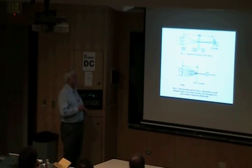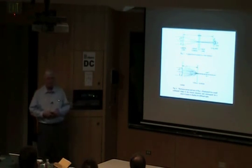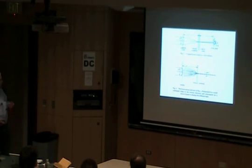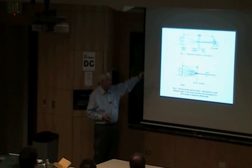So I looked at that and said, well, let's pretend the light's going the other way. We're going to replace the eye with a laser beam and hit the focus screen. What we want the focus screen to do is to spread the light over the aperture of the lens. And that can be described mathematically. You make some assumptions and do calculations. And I want to do 2 things. I want to make it as blurry as I can get it without losing too much light, and I want to get as much light through as I can.